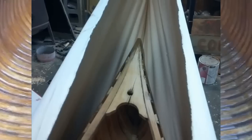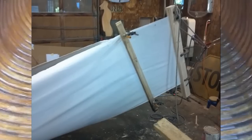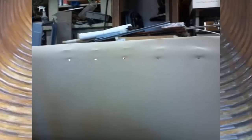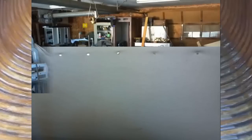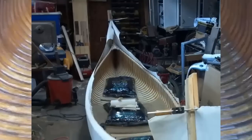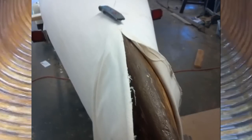Too tight a tension and you can see rays and creases forming in the canvas. In Jerry's book it said if you get those, back off the tension and let it lighten up a little bit. Once it's lightened up, you go ahead and trim the canvas down the whole length of it so you can grab the canvas with a pair of pliers, pull it up, and put in a brass nail. I cut the sides down, pulled all the sides up, and nailed it the whole length. Then I released it from the clamps on the ends and flipped it over to split the canvas.